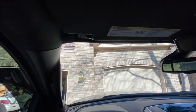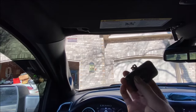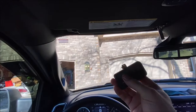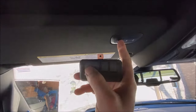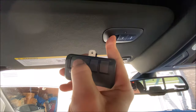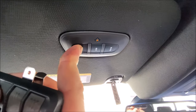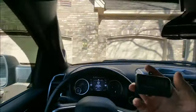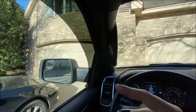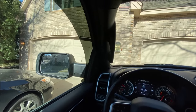This is going to be a little difficult to film, but what you want to do is have the original remote — or a working remote for the garage door that you know works. Hold the remote button and the HomeLink button you want to program at the same time. This should start flashing rapidly once it works. There we go, it's programmed. Release both buttons — you'll notice the garage door did close, that's normal.